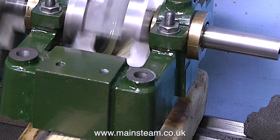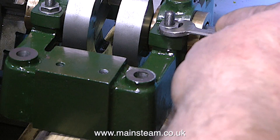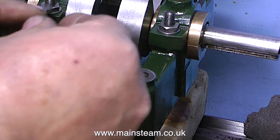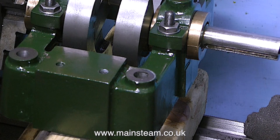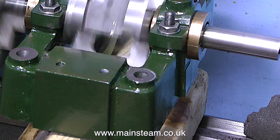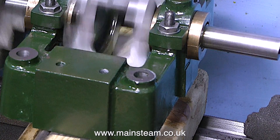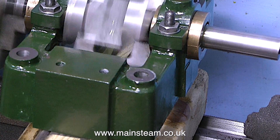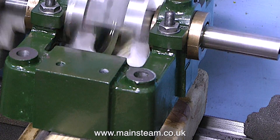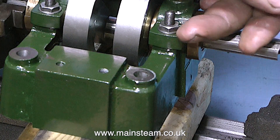I still intend to fit oil seals on the outside of the bearings — I've done this many times and it's successful; it just stops oil from running down the front of the soleplate. In this clip, I've stopped the lathe and I'm just tightening up the nuts that hold the top caps in place, then I'm going to give it another run. Before I restarted the lathe, I checked the temperature of the bearings with my hand, and they were both perfectly cool — that's a good sign. Any heat in the bearings means friction, and there's so little friction going on here, I'm really pleased with it.